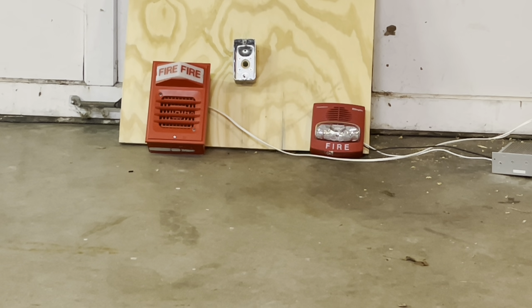All right, so that little hang-up set aside. Now we got vintage versus modern simplex. The 2903 light plate with the 9806 horn and the 9425 True Alert. So let's start with the True Alert. Oh, gotta set the decibel reader. There we go. And here we go. And that was a whopping 120.1 decibels. Not the loudest horn. Definitely quite effective though.